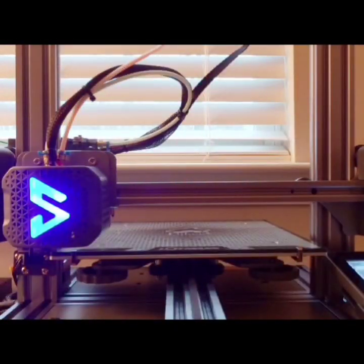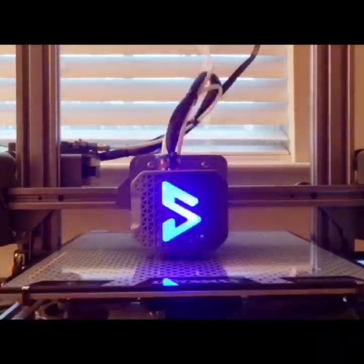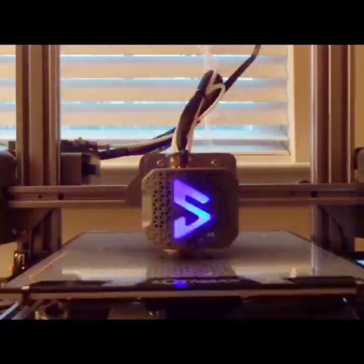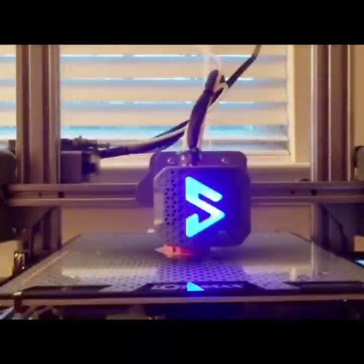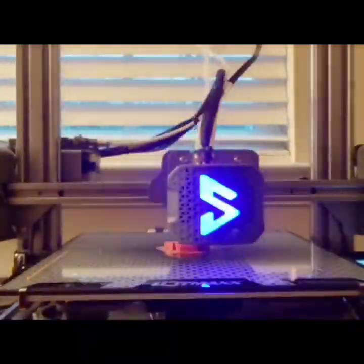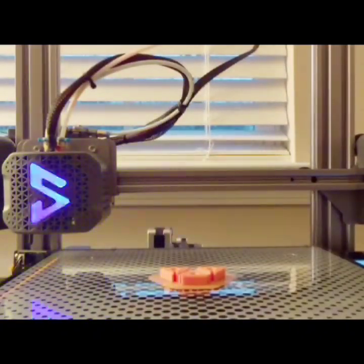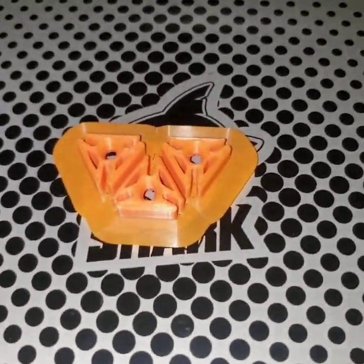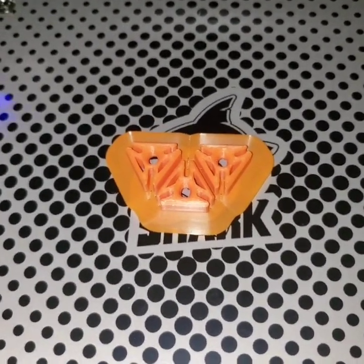Finally, I wanted to print something really small. I really like these K2 filament clips — these little triangles with three slits in them. I tried printing these several times and they just would not stick to the glass bed, so I ended up having to put a brim around them, which seemed to work out okay. Printing small things is a good test. Had to use a brim, but it did work. They look great.